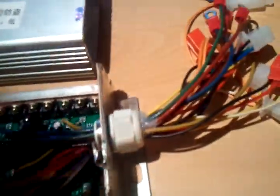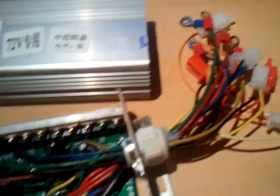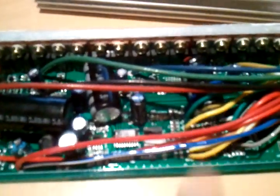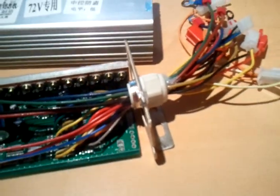I'm just going to rewire some of these cables that don't need to be used, such as the phase wires here. You can short these two yellow wires to get 120 degree phase, I think. But if I need that — which I'm not sure just yet — I would just short it directly on the board here. And I'll use the wires for something else like connecting to regen and reverse and a 3-speed switch, although I think there's only 2 speeds. But we're still trying to figure out what the Asian manual says, so maybe there is a 3-speed functionality.